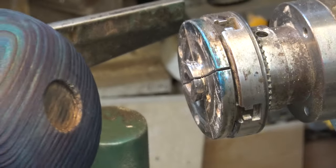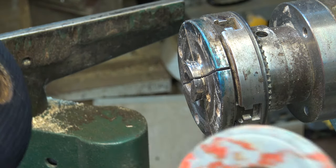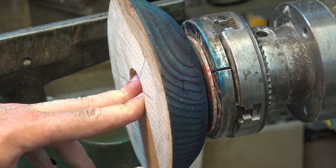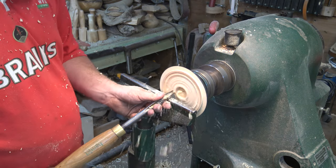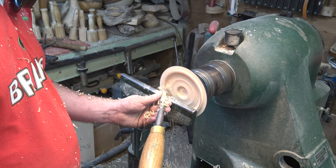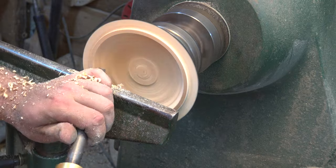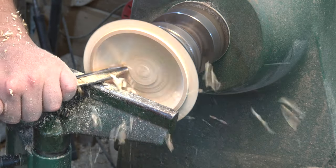I'm going to remount this now to the lathe. I've got a little bit of gap between the face of the jaws and the piece, so I've got a load of these little plastic rings I've machined — they're perfectly flat and just take up a little bit of that slack, which will help support the piece from wobbling and give it a nice strong hold. We're just using a dovetail scraper to get the outside of that box sorted and hollowing out the box — exactly the same principle as before. Making sure my tool bevel is rubbing all the way down to the bottom, establishing the walls, making sure I've got an even thickness throughout. Then I can start hogging the material away from the middle, with my tool handle down, rocking with my whole body, not just my arms.